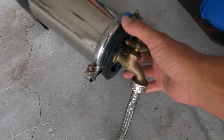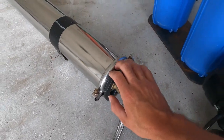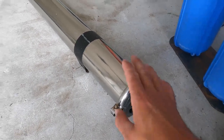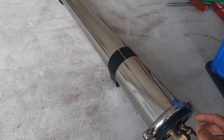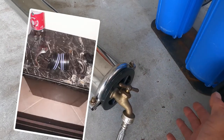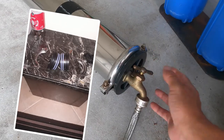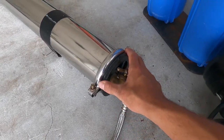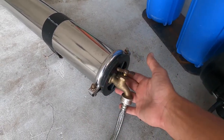This is your wastewater side, so this would be the bottom of your RO tank. You slide the membrane in from there — it'll go into here. You want to put this cap on first. It's simple — it's literally just pushing it on and using an O-ring so water won't leak. You want to get a good fit. Sometimes you might need a rubber mallet. Honestly guys, this went in very easily for me.